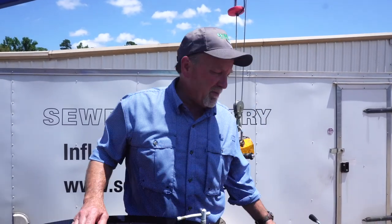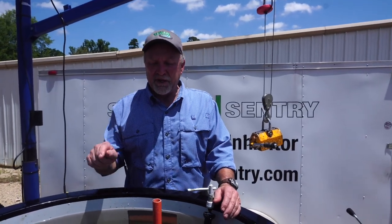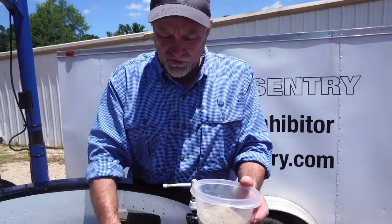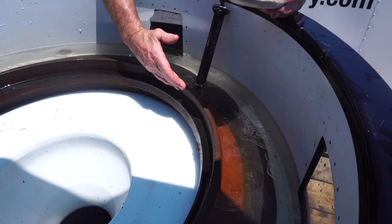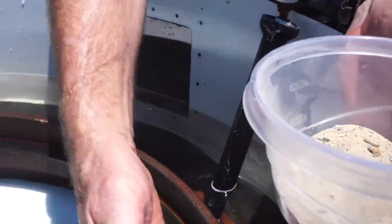You remember the pump station we showed you before, 300 gallons a minute. How many holes would it take to go underwater 6 inches to overcome those 300 gallon a minute pump station? Okay, how many? When you don't clean your manhole covers, that little bit of gravel and sand that gets between the manhole ring and cover because of rain, because of traffic and whatnot, this is what it looks like that's out in the streets. That gets right in here. It falls down on that rubber.